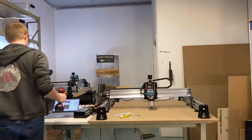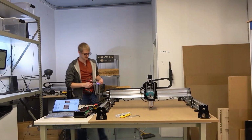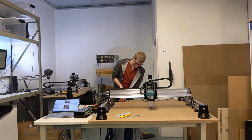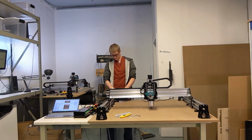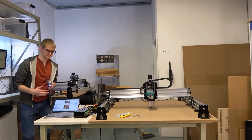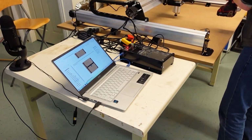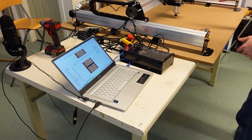And I'll just say the skewing that you saw there, basically what is happening is that because we initially placed the y-axes on by hand, it means that the two sides are going to be misaligned from each other. And so you don't notice anything when the machine is on the table, just loosely, not fastened in place, because nothing is putting it under stress.